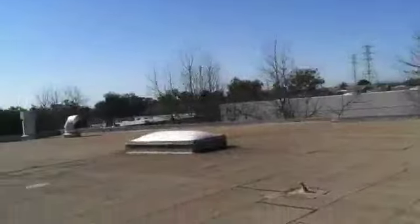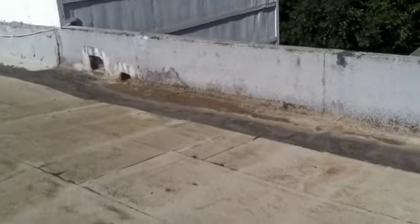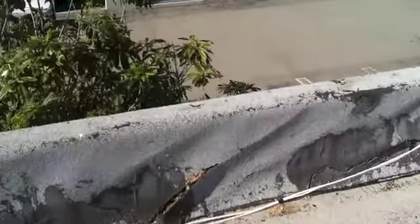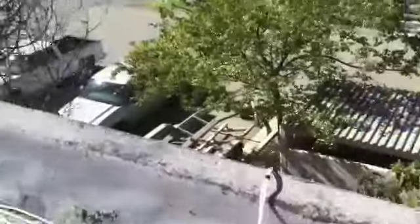All the water travels from the high point down to here, so you'll notice a lot of water ending up in this area. We've got some ponding water in a couple of areas. You want to handle these by first scraping out the additional mastic in that scupper drain that's causing it to pond, and then reinforce this area as well. Back here on this back wall in particular, there are certain areas we're just going to strip down completely. You can see there are cracks here — there's definitely a leak source there, and on down the back there are a couple of other areas as well.